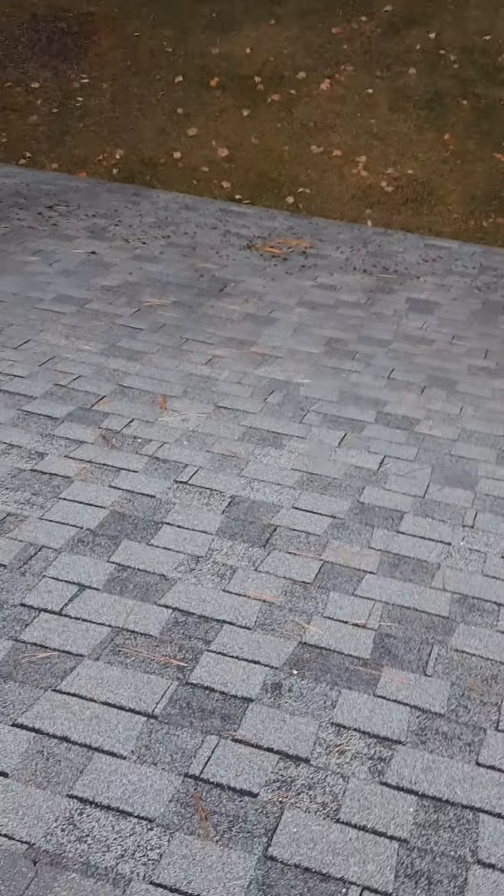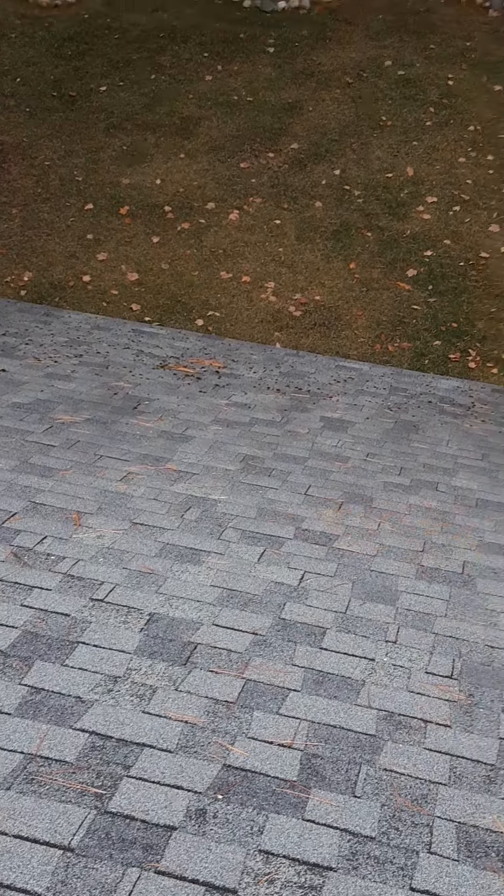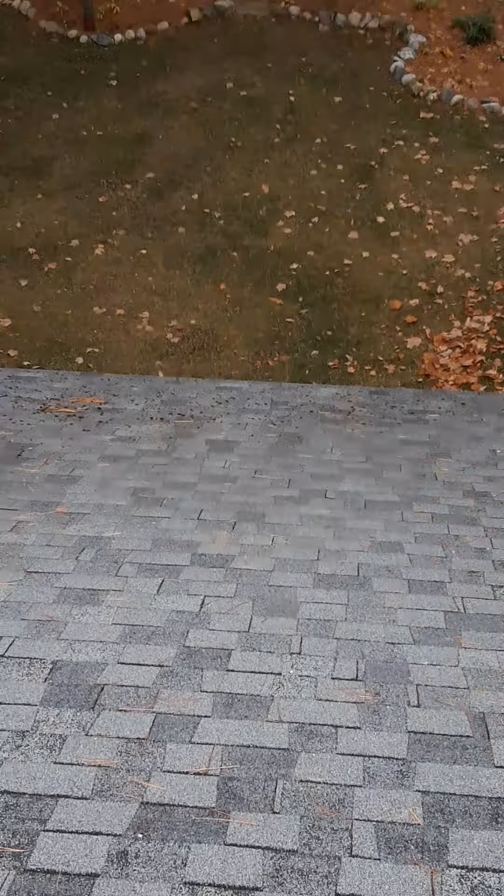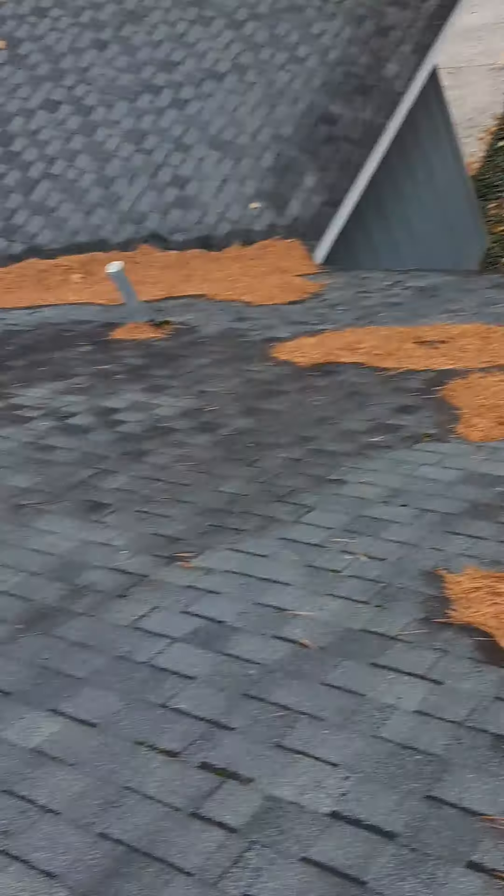Another thing I did want to point out - look at the debris up here guys. That's just as bad as the lichen being up here on these shingles. What I did notice when I was doing the estimate - I like to pay attention to stuff like this. You can see the difference right here, see the line? See the transition - that's old shingle, new shingle. So obviously something happened, they patched it or whatever. It's something you want to look out for; stuff like that can come back and kick you in the teeth. Just pay attention when you're doing roofs.